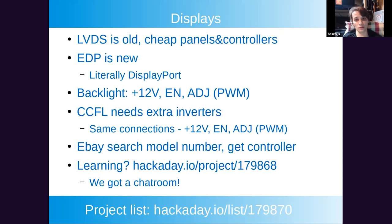If you're using a CCFL panel (the older backlight type, usually LVDS), you'll need an inverter — you can typically reuse the laptop's own inverter. For eDP panels you can just take the model number, plug it into eBay, buy the $20 kit, and you're done. If you want to know everything about a panel or reuse it in a power-efficient way, I've been building a knowledge database — it's about 30% complete — and I've also been compiling a Hackaday.io project list with links.